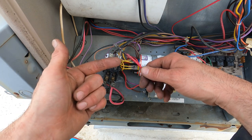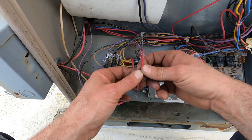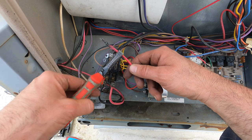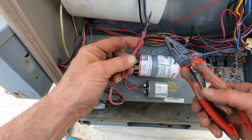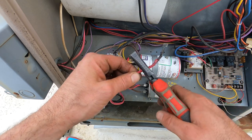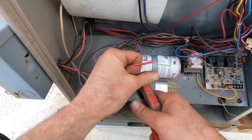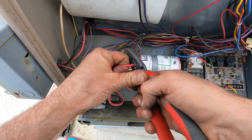This happens from a loose connection — that's the only reason why you get this bubbling, melting, and overheating of the wire. I'm gonna cut it back. If you go too close you'll have a hard time getting that insulation off because it's just hot and melted. Somewhere behind here should be safe — I need to go get my wire strippers but I left them in my truck.